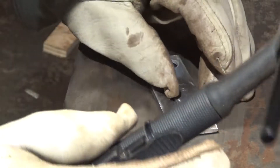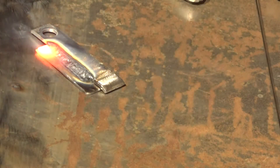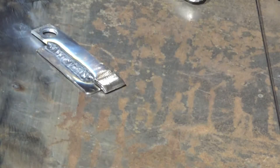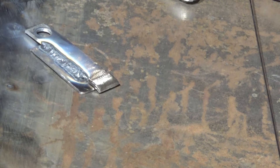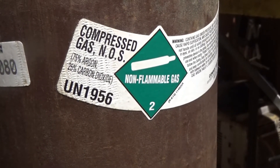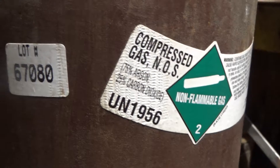I'm just going to go for it — I don't care how it looks. At this point I kind of started figuring out something wasn't right. I know my travel speed was a little bit slow but it wasn't that bad, and the weld was way too gray, way too ugly. I started checking my gas flow thinking maybe my argon wasn't flowing, and then I figured it out. Once I saw that really dark gray color it reminded me of a MIG weld — and I only buy 100% argon, but they gave me a 75-25 mix.